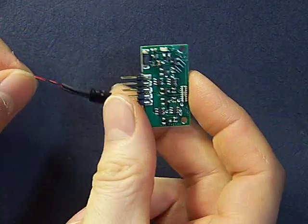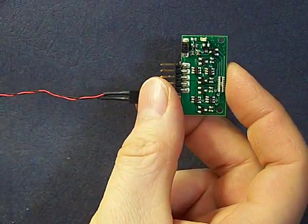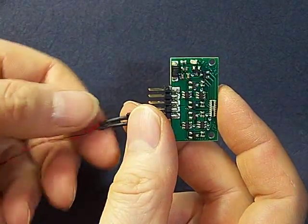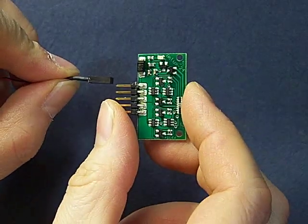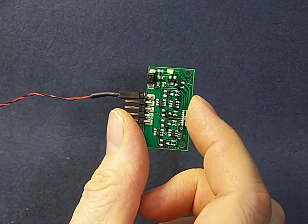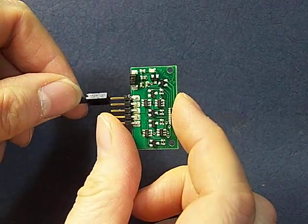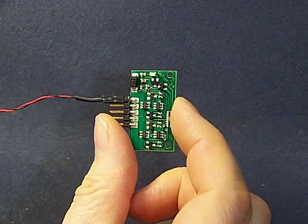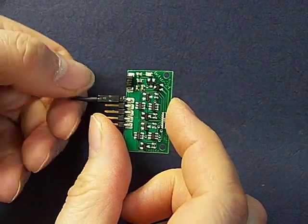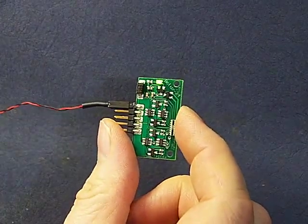Here's my deluxe 24 card and here's the power supply cable. Notice the power supply cable has a red and a black lead on it. I'm going to hold the card front side towards the camera and the red lead front side towards the camera, and I'm going to plug it in just like that. See that little green light came on? That's perfect — that's exactly what's supposed to happen. Now let's suppose I make a mistake and hook this thing up backwards. No green light. The card's not damaged — it's made to handle this. All I've got to do is unplug the power and turn it around to face it the right way. That's it. Power is hooked up.